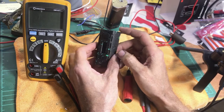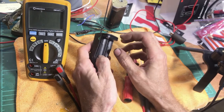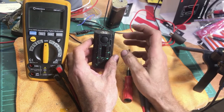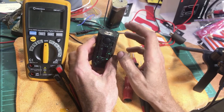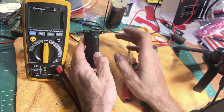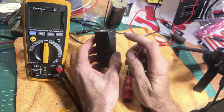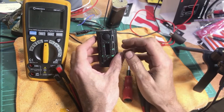There's no point getting into your device and possibly messing something up if it's under warranty — that's what it's there for, use it. So let's say you're obviously getting 'check atomizer' errors and you've tried it with lots of different atomizers, or at least a couple. You're getting the same error — just want to double check it's not actually the atomizer, a dud coil, or a short in your build. If you can use the atomizer on a different device and confirm it works properly, do that.